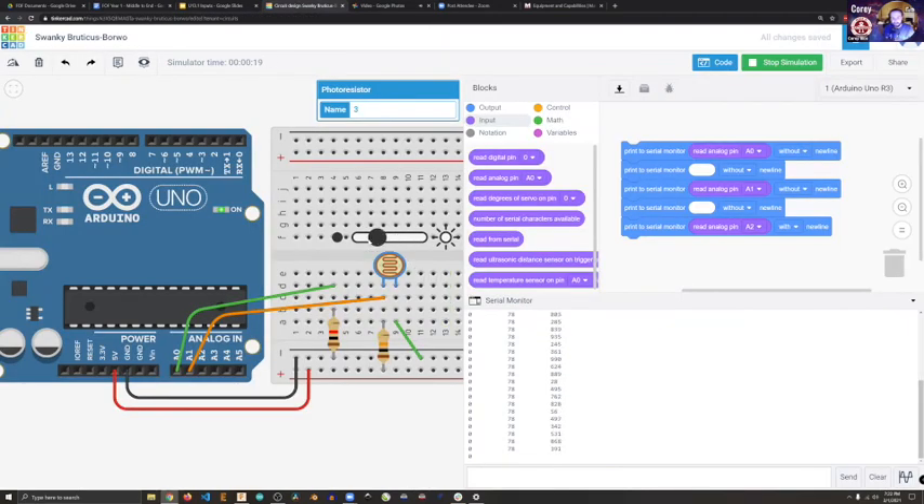Like I would be able to pretty easily say, well, when it's dark on the left — I could say, when it's dark enough, turn on the lights. That's a very reasonable ask for a microcontroller. And so I would just need to watch this value, and maybe I'd say if the value gets to be larger than a hundred, then I want you to turn on the nightlight — and if it gets lower than a hundred, turn off the nightlight. So you can start to do informed things based on your input values.